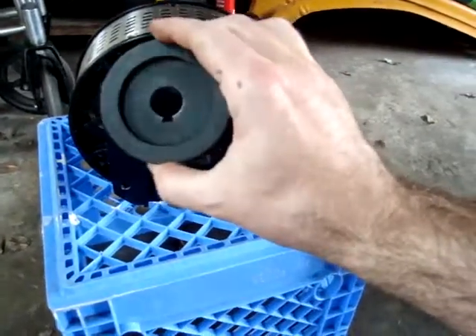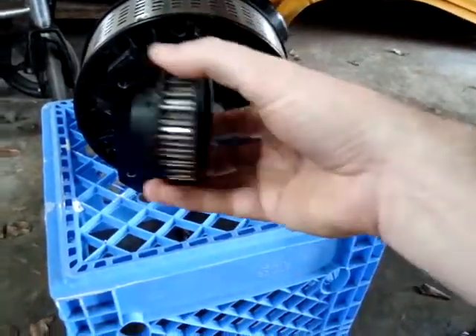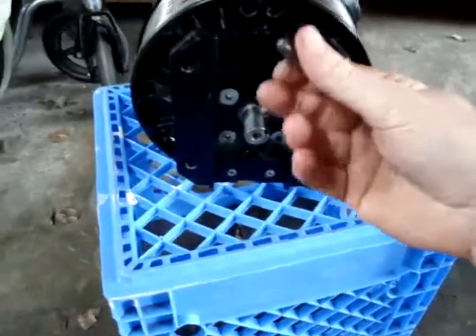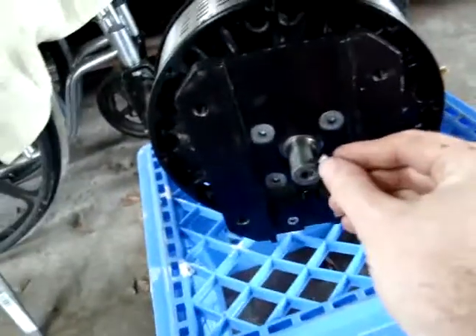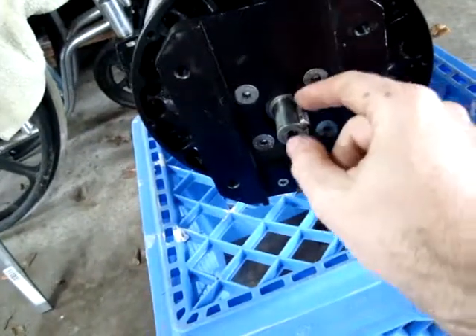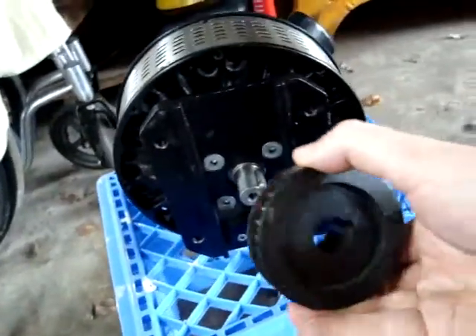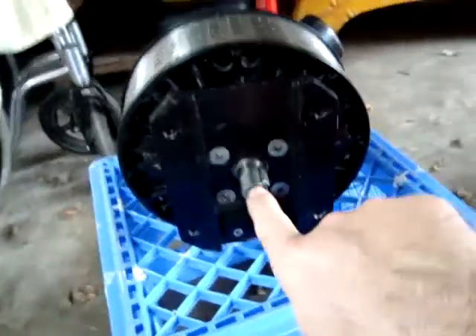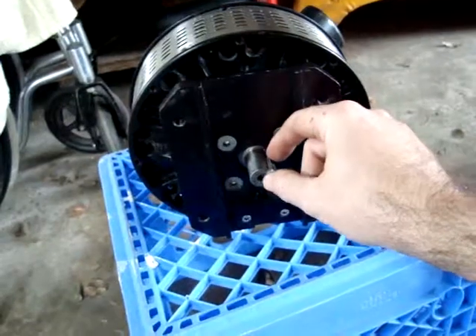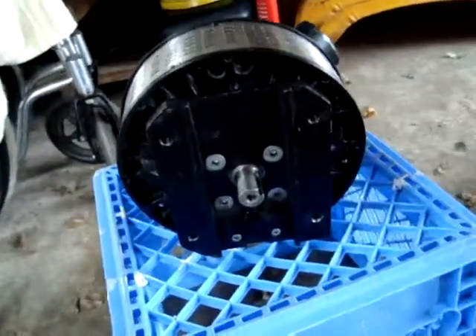So there's the old 28-tooth pulley and it's even stamped on there as 28T. Once this is removed — and by the way, there was a little keyway that comes with it and it slides into this slot here and then the accompanying notch on the pulley. They all line up. Otherwise, the shaft would spin and spin without grabbing the pulley when you're trying to go. This is important — I'll talk about it more later.